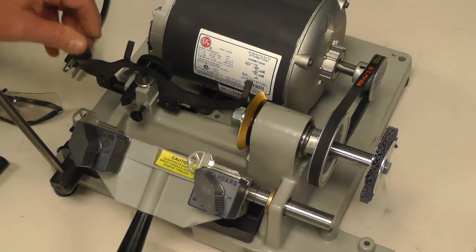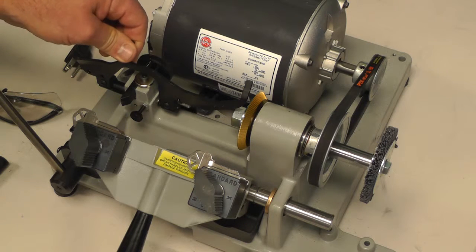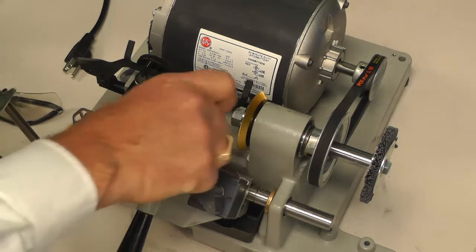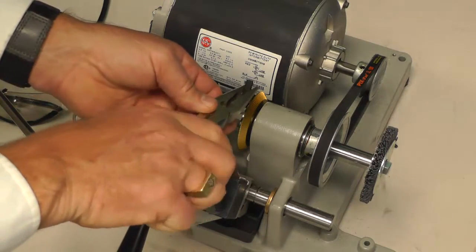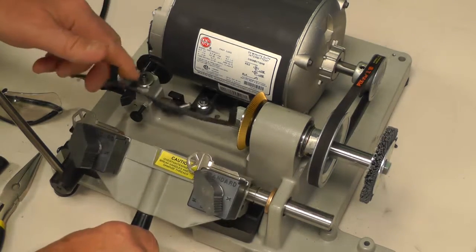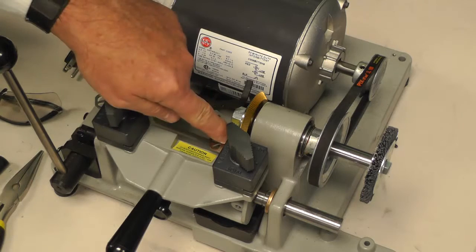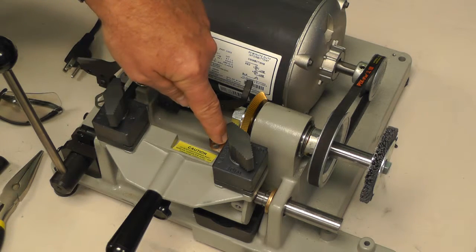If it's more than that — and these gauge forks have a tendency to get bent a little bit and need to be tweaked into shape — you would grab a pair of slip joint pliers or needle nose. Sometimes I like to use a crescent wrench or adjustable end wrench so it doesn't mar up the surface. You take this right prong and just slightly tweak it towards the right. But every time you do that, you always bring down your gauge fork again, re-shoulder, and go back and do your test, looking straight down. It's always a good idea to have a nice strong light, because this is a very critical adjustment and you want to make sure it's correct.